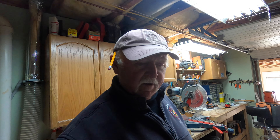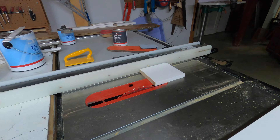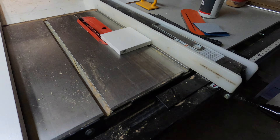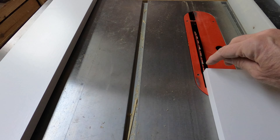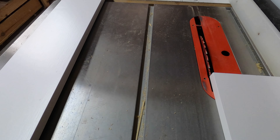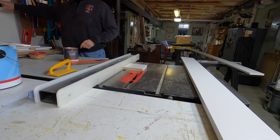I ran into a little problem on my second baseboard — the floor is a little bit off. So what I did, as you can see, I scribed in a little line here. But it's more so over on this end. You can see there's a line I scribed in all the way down to about here. What I'm going to do is set the saw blade for an angle — it really doesn't matter, as long as I can chew off a good amount of the edge to make it easier to sand if I need to take them down. So that's what I'm going to do right now, I'm going to give it a shot.